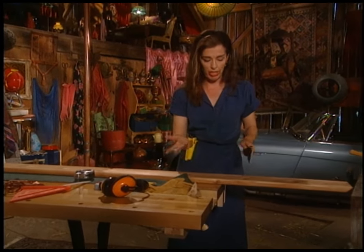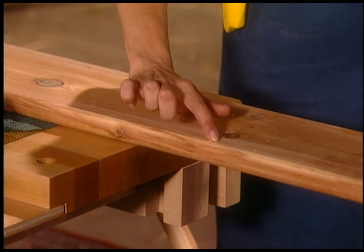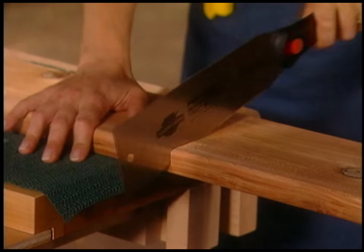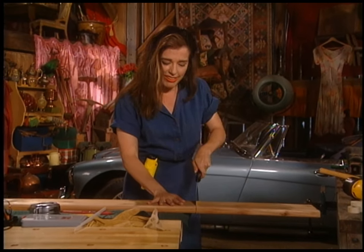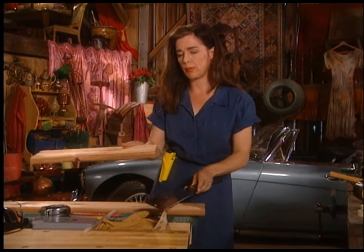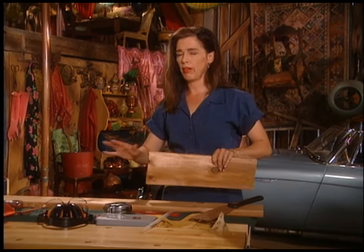The big teeth — watch — they make a really big mess. So you want the fine teeth on a cross-cut. When the tone starts to change as you get close to the very last saw-cut, it's starting to get lower. I'm just going to brace the board and grab the cut-off bit so it doesn't all splinter at the end. More board cutting in store for me, and then I'll assemble the box and go from there.